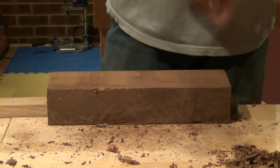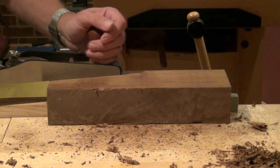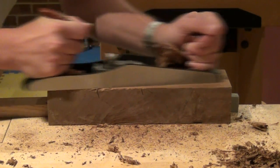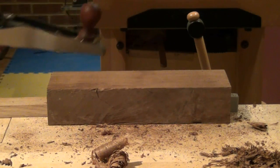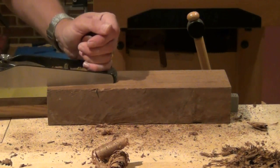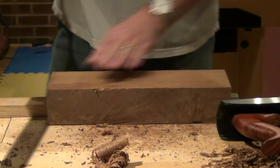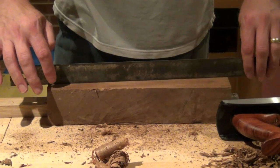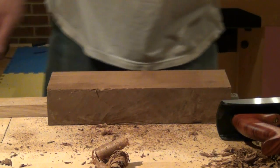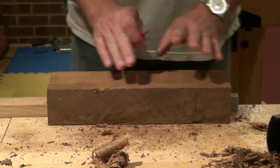There's still a very slight hump in the middle, so I'm going to do a stop shaving - or a set of stop shavings - cutting from here to there. You can just do this until the plane stops shaving, but I've got quite a thick shaving set on the plane so I don't want to create a huge dip. And that's wonderful - my straight edge is now pivoting at both ends. Just recheck the twist - that's no longer in twist. So we've got one flat side.